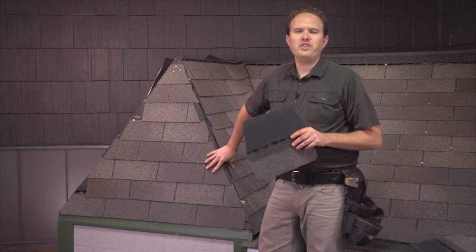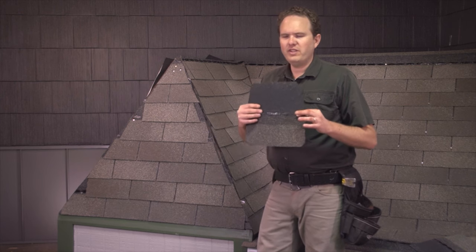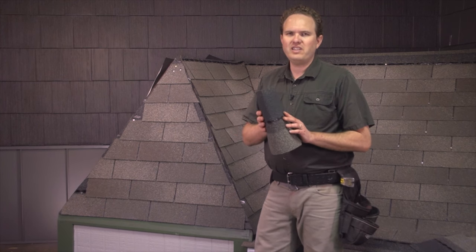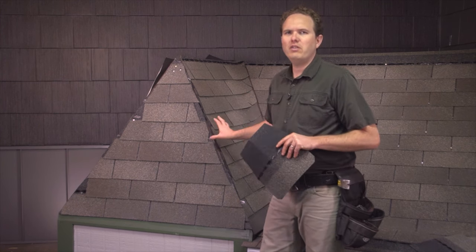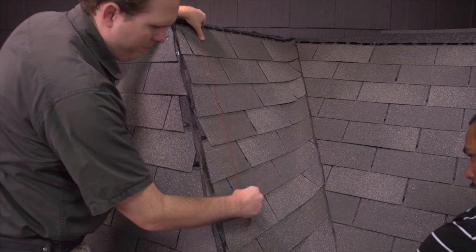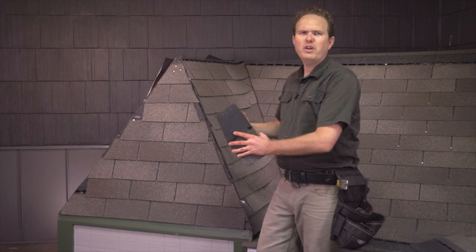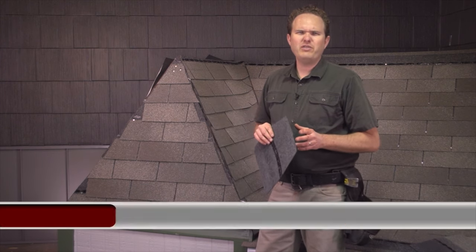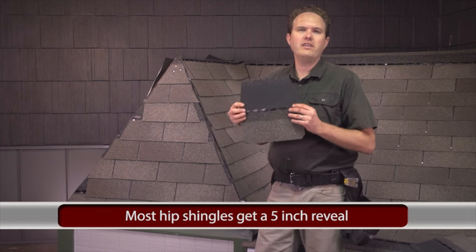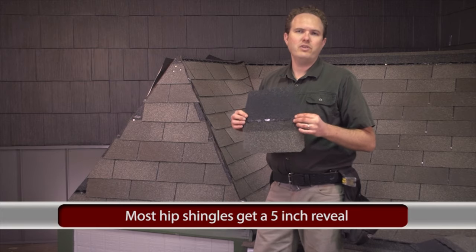Applying these shingles is pretty straightforward. Your main considerations are to make sure you're using a nail that's long enough and to run the shingles in a straight line. I like to apply the first hip shingle making sure it's square and even on both sides of the ridge. Every tab you use for hip and ridge is going to be one foot wide, so folded it's six inches on either side. Make marks six inches from the middle of the hip, snap a line, and that guides the right side of the shingles going up. Hip and ridge shingles get a five-inch reveal, just like in the field. Place two nails in the middle of the tab, essentially the same place as in field shingles.